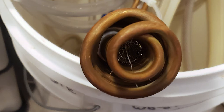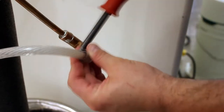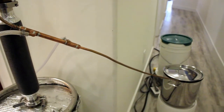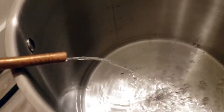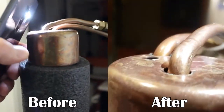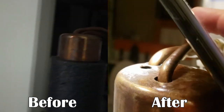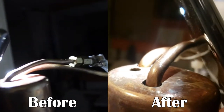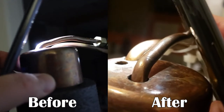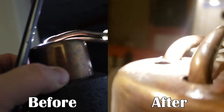I then went about doing my stripping run as I normally would. As you can see from this video, the puffs of vapor have completely disappeared. And the conclusion I draw from this is just that the vapor was shooting up the middle of the center coil, making it way past and escaping through that pressure release hole.